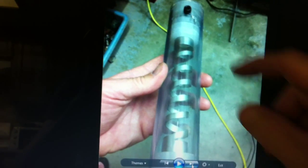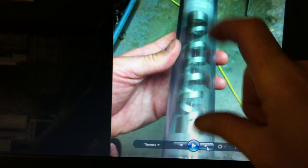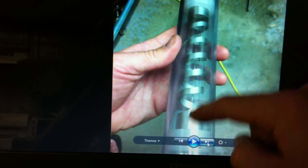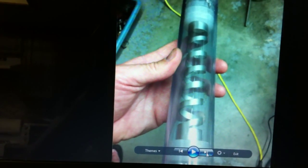This is just testing. I needed to make sure that the two layers of the end caps on the spiral design were nice and loose, because if they're too tight when I push that in there the spiral acts like a spring and the wire gets loose and the outside pipe can bend. So I just had to make sure it was real loose — and it worked.